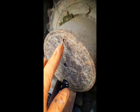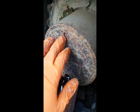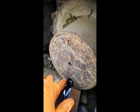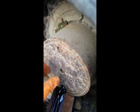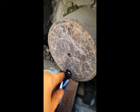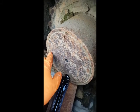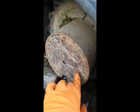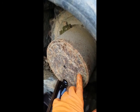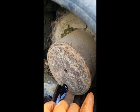So on this digger now we have a fill, well, it says drainer but works anyway. You have a fill, your level, and then your drain. But on most things you only have one like this right on the edge, or one there, and forget the other two. So on something like that you have to have it at the bottom to drain it. Then on 99% of things, the level will be straight in the middle. So you need that plug to be at either 3 o'clock or 9 o'clock, thinking of it as a clock: 6, 9, 12, 3.